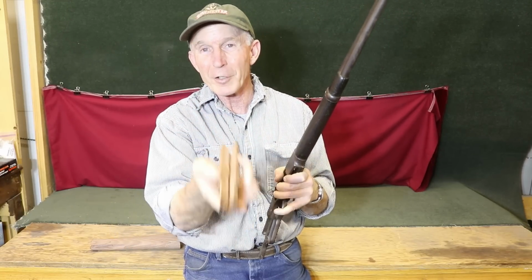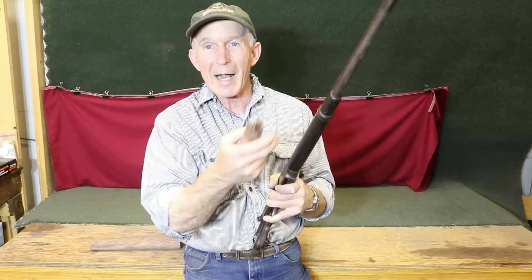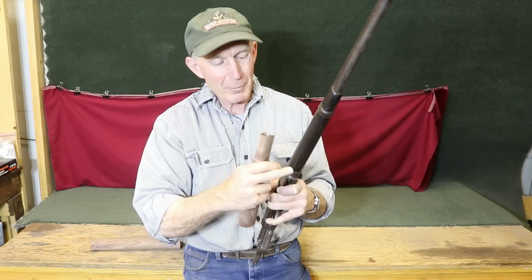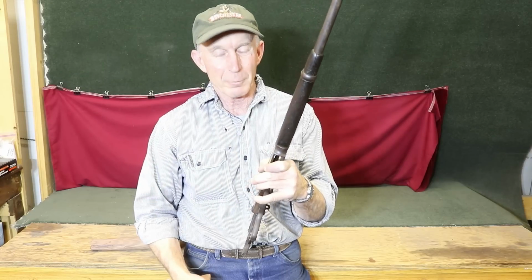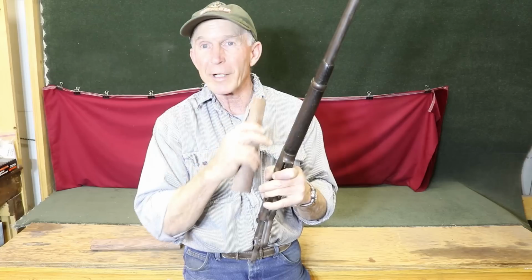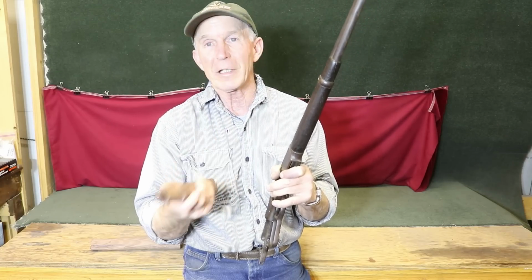And of course the fore end, the channel is a little bit small, so it has to be, again, inlet black, scraped in, tried again. We got to get everything a little proud here, and this cut completely straight up against that receiver. It is just a slow process. When we get all that done and fitted up properly, then it's time to finish the thing.